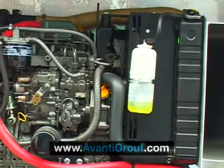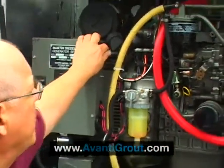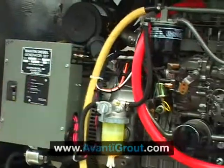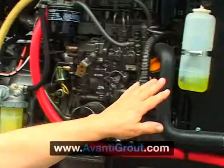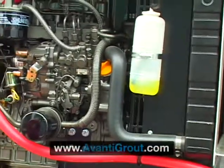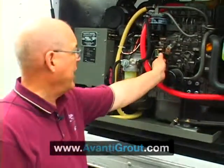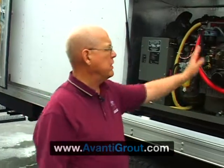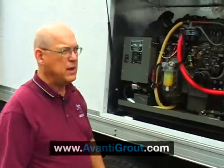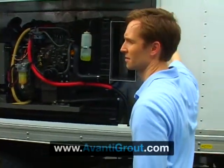This unit has a power plant that we really have a lot of confidence in — it has given us highly reliable performance. As you can see, there's a main circuit breaker out here, a couple of switches for cold weather operation, a preheat, filter systems. This is the working side — you can see everything is visible. We encourage every operator at the start of the day to come out here, look at his rig, check his oil, see the level of the coolant, make sure there isn't a bunch of dirt collected in here in a storm or something. Contractors learn how to maintain it in a hurry.